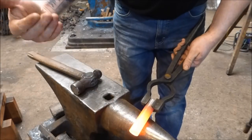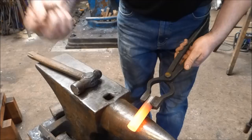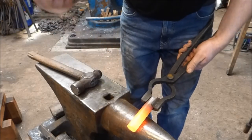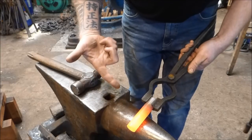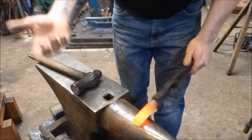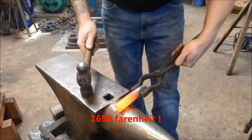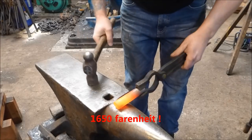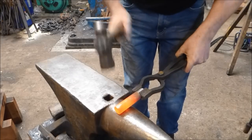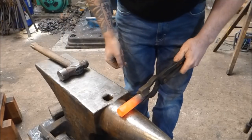I don't believe titanium is a very good conductor. This is why it's great with heat — it heats up quite quickly but then dissipates the heat just as fast as it took it in. So I think this will get cool a lot faster than steel, for example. It also wants to be forged above 900 degrees Celsius. That's hard. I am forging it, but wow. Okay, I'm going to put this back in the fire and start getting this hot properly.